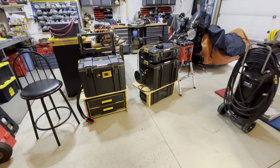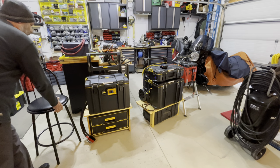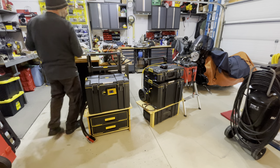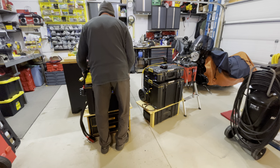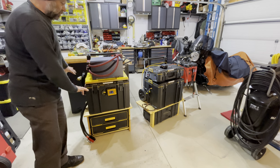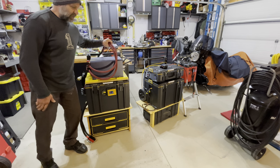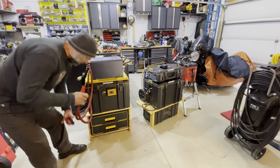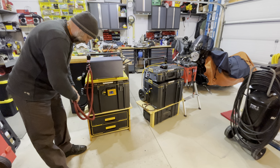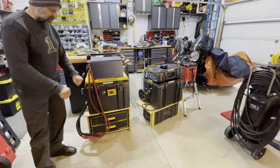If you're at a trade show with a pavilion booth or setting things up for a tailgate party — that's the mindset of these batteries. They're able to be moved around and have multiple uses. You hear the two clicks? I really do like this screen — if you have it set up in your trailer and want to check it quickly you can do a quick visual, but by and large you're going to be using the Bluetooth app. I'm not sure why I have such good success with the Anderson connections not causing sparks — maybe because slowly inserting it slows down that inrush current — but I've never wrecked an inverter that way.